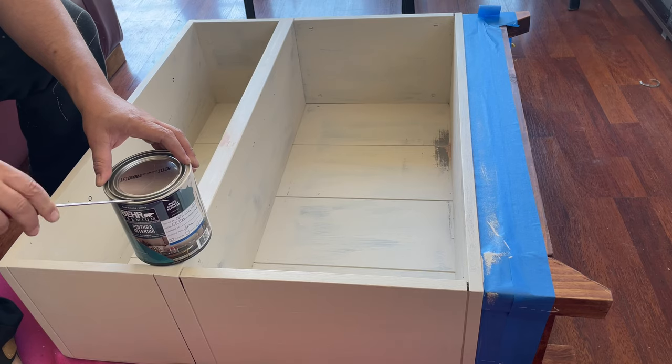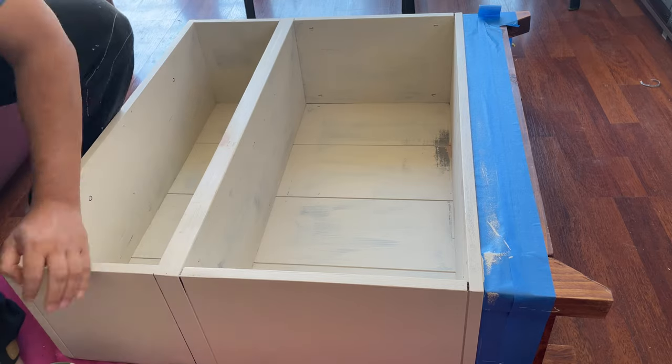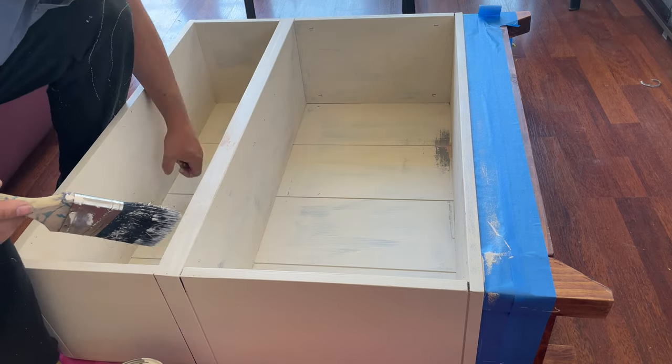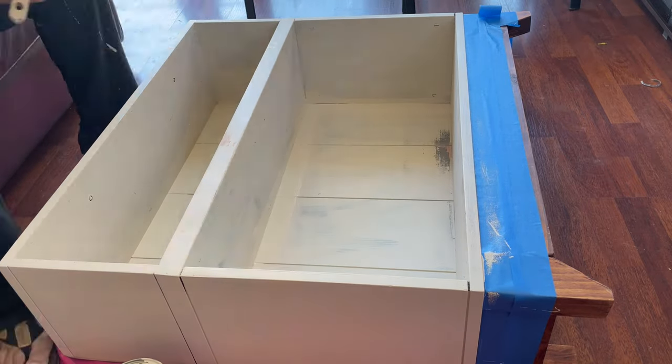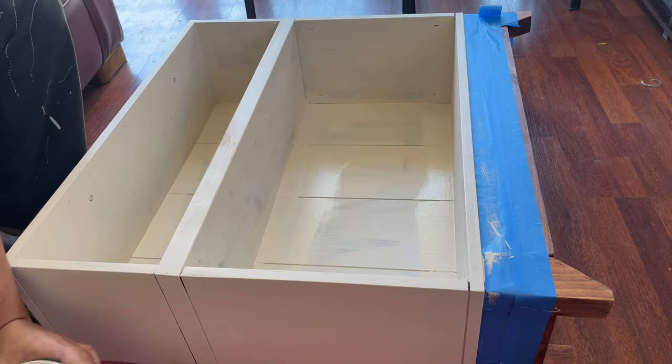Remember I told you about those details appearing with the paint? Well, here they were. I mean, nothing serious, but some scratches and gouges that made my life miserable. If I flipped something, I wanted to be as perfect as possible. So I applied some wood filler and sanded well. I applied a total of 3 coats, sanding lightly in between.